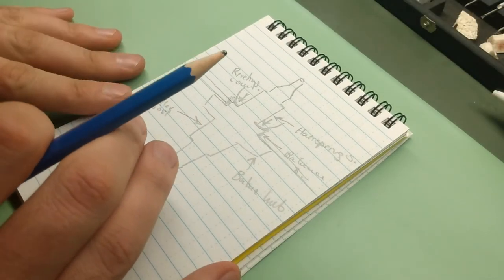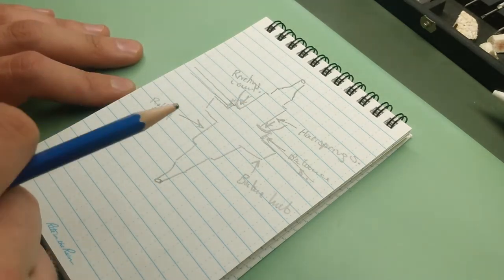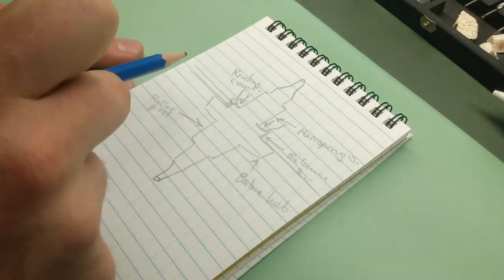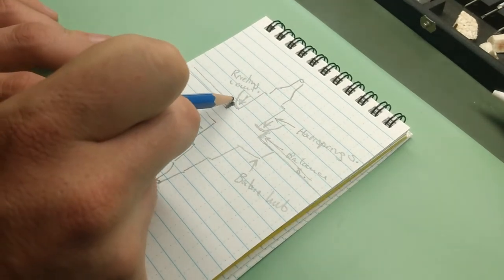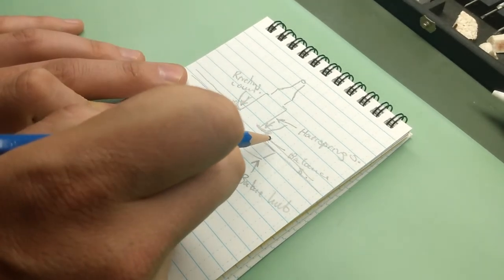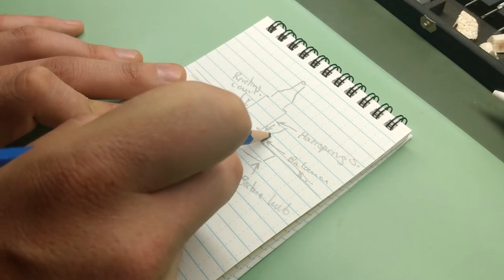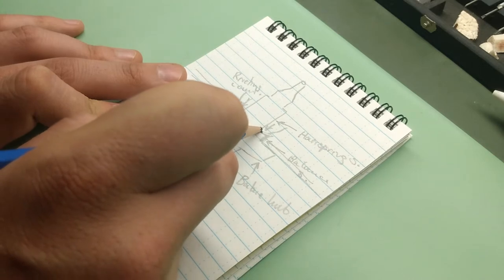Okay, let's come in for another edition of What's Our Objective? Here I've drawn a not too elegant drawing of a balance staff in a balance hole, with some balance arms. This part of the staff is the balance shoulder. It should pass through the hole in the balance wheel, hopefully snugly, although this isn't always guaranteed. On top of the balance shoulder is what's called a riveting countersink. This is a slight undercutting of the balance shoulder so that you have a little lip here.